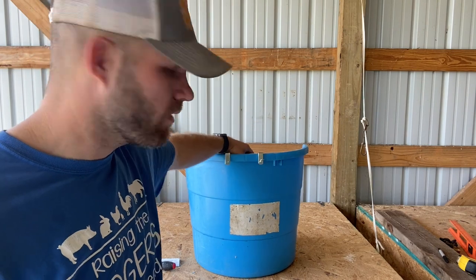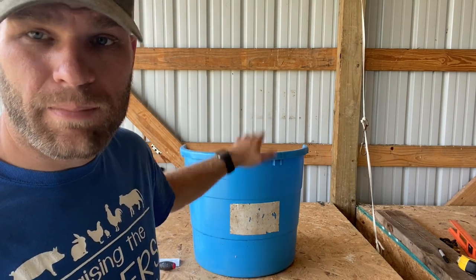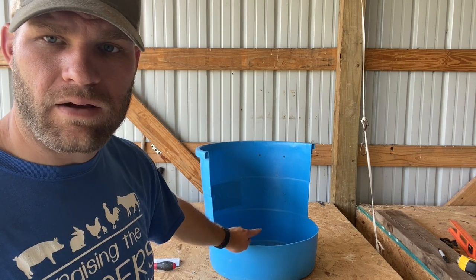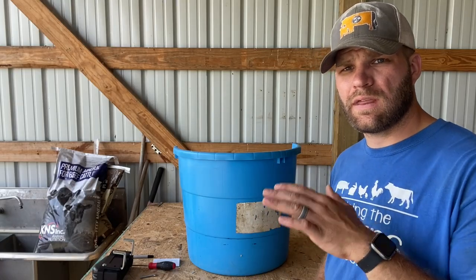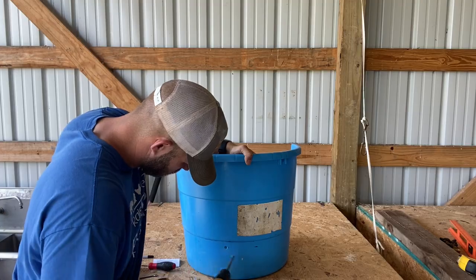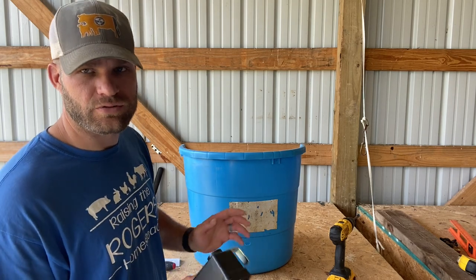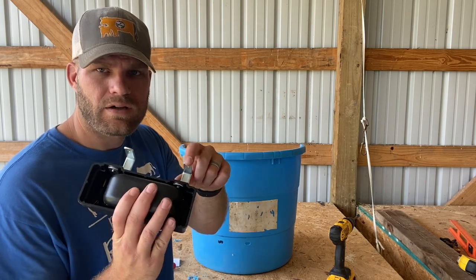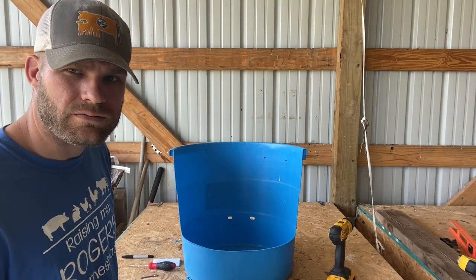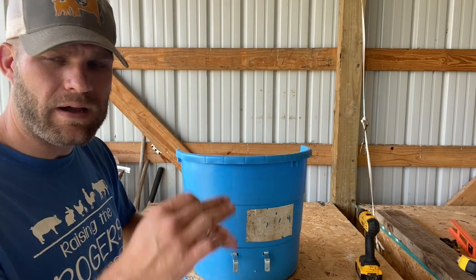These things make great cattle waterers as well — that's what I use them for. They just hang on the back of the trough and you can fill it all the way up. But we're actually using this for a pig waterer, and a pig is not this tall, so you have to put it down in the bottom. We're about to drill the holes for that and then put this in. Now we've got our holes drilled — I had to actually drill two holes because my bit wasn't big enough. Just drill them side by side and kind of waller them out a little bit so that the screws will fit through. We're going to stick these through those holes — it should sit in there just like that. Take your long screws, put them in the back, and that'll hold that waterer straight.